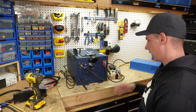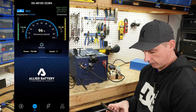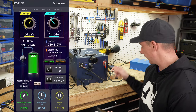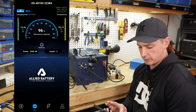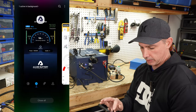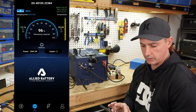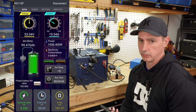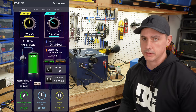Okay, ready to start the discharge test. Let's turn on the inverter. We're discharging at negative 14.6 amps on the smart shunt. Let's increase that power — now we are discharging at just under 20 amps, about 19.6 to 19.7 amps. Checking the smart shunt: 19.6. So we're right in the range that the Bluetooth app is calculating. I'm going to let this test run and I'll be back with the results once the test is done.